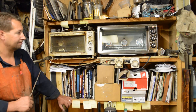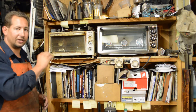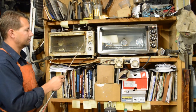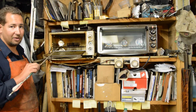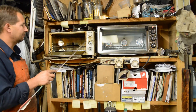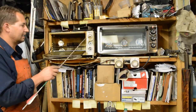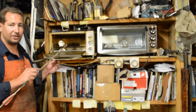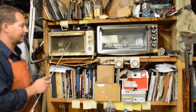I've been using a toaster and having really good luck with it, but you have to set the toaster up right. This toaster right here only does 1095 and 52100. You can see the temperature on it is set at 450, but I've got two oven thermometers in here — they stay with this oven, they never come out, they never move. When this is set properly — and I never even touch the dial — the top thermometer reads 350 and the bottom thermometer reads 385. If that dial ever gets moved and these thermometers aren't reading 350 and 385, then I know something's wrong.